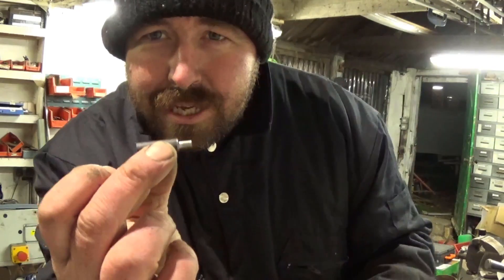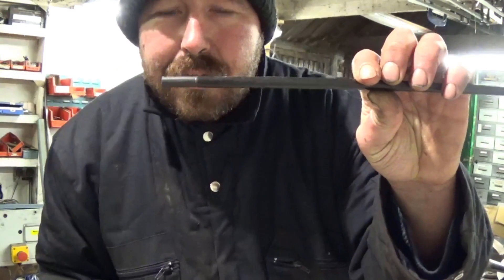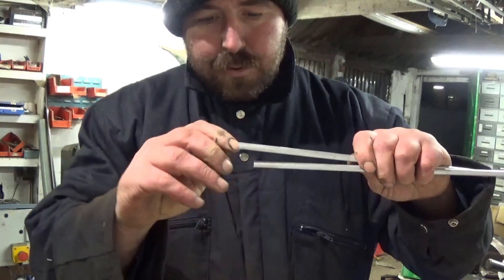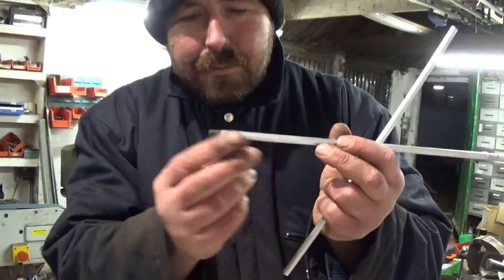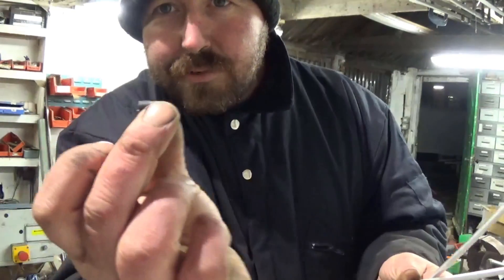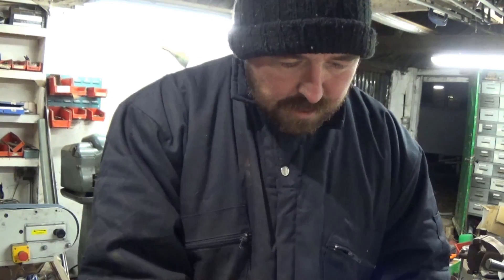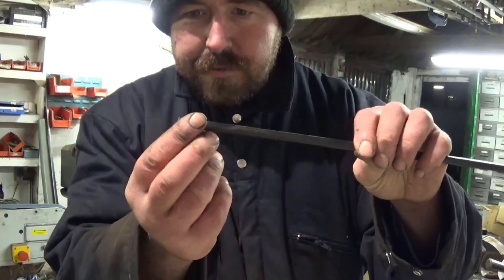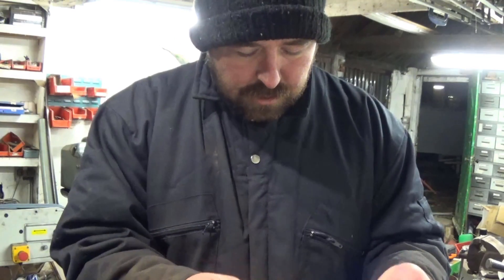I've got 10 bits of steel turned down — these fit right inside the tent poles, just like that. I did a couple that would fit in the aluminium as well, a little bit smaller because I want to keep the weight down on the alloy bolts. It'll be a nice experiment to see which performs best. This one I was just going to sharpen to a field point; this one I made even shorter because I'll put a square hardened steel point on the end. For the glass fibre poles, maybe one of them I'll just put a field point on it.